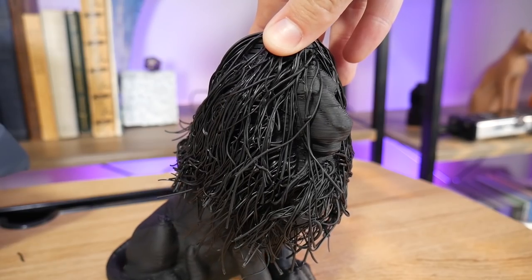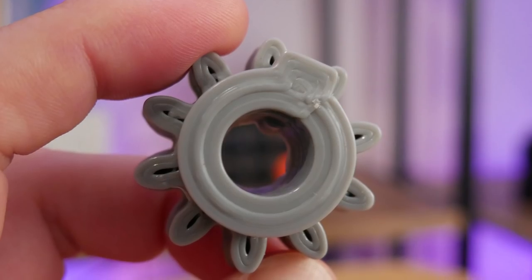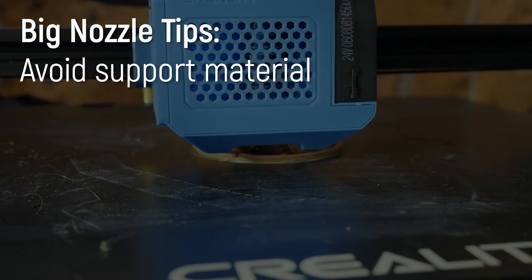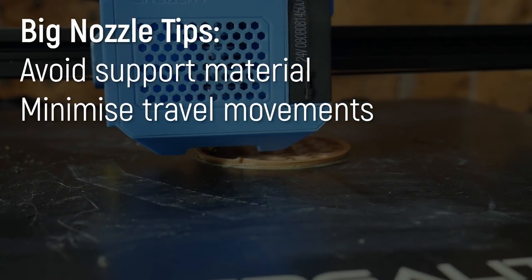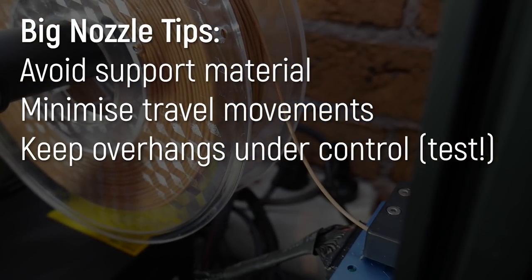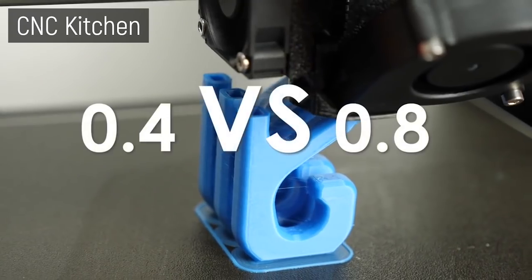Chunky FDM models have a certain aesthetic that I really think is complementary for many applications, especially where speed and strength are paramount. But it's clearly not for everything — the quality sacrifice is severe, to say the least. For sheer speed and strength you really can't do much better, and I encourage you to try it. For best results, choose models which don't need support material and can be printed with large extrusion paths that don't require the hot end to jump around too much. Watch your overhangs, as they can quickly reach the limits that these large layers are capable of self-supporting. These prints also destroy your filament quickly, so be sure to have a lot on hand.